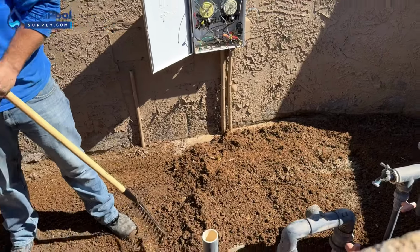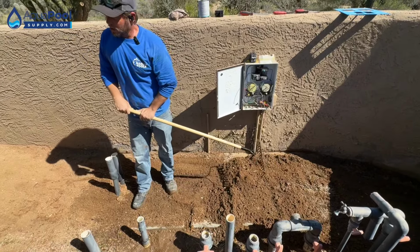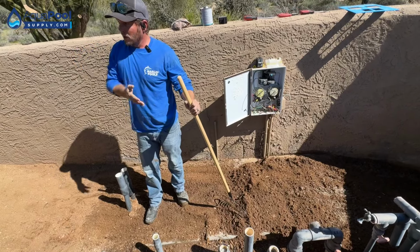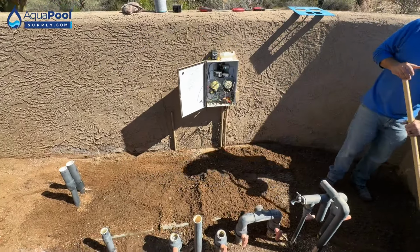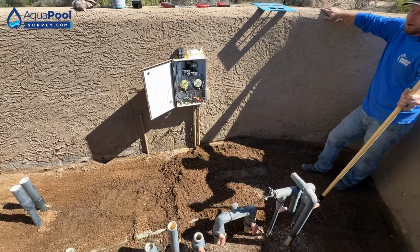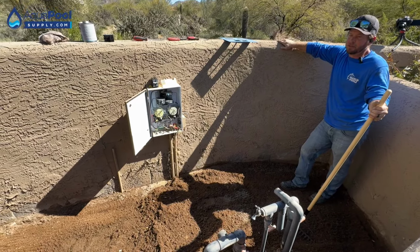A more solid base for everything. That's my theory behind it. And we're gonna get up in elevation versus being lower in the ground. So I always like having stuff up above so you get runoff on all sides of the pads. Oh, so if you lift, I know people lifting those and putting dirt underneath is not a good idea because of settlement. I wouldn't unearth them. Not unearth them, they're already settled. Yeah, because then you'd be asking for more settlement to happen. Gotcha. Okay.